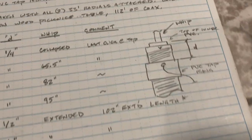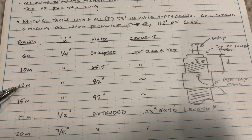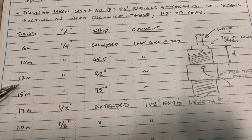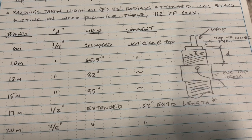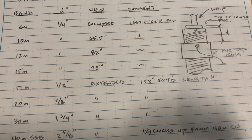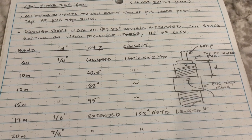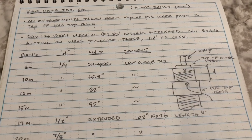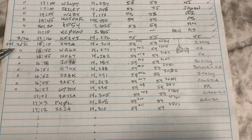That's the setup. It worked well for me — all the tunings except maybe 15 and 12 meters came out to 1.5 SWR or less without a tuner. Those two were up around two and small changes didn't seem to affect them much, possibly due to the radials or my specific setup. Essentially you're getting 1.5:1 SWR across all bands between 6 meters and 80 meters. This coil can also be used as a mobile antenna — obviously you'd have to get out to change the bands, but it's certainly built robust enough. Kudos to Wolf River Coils for producing such a good antenna.